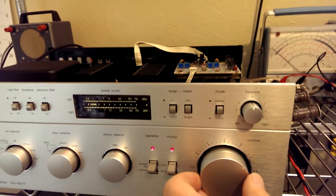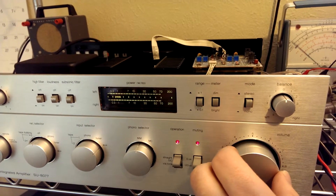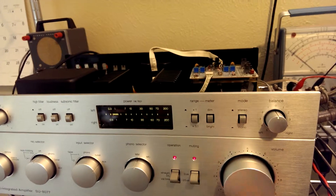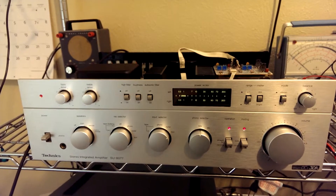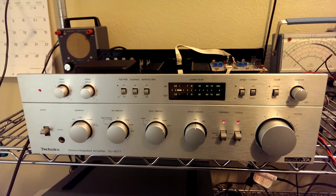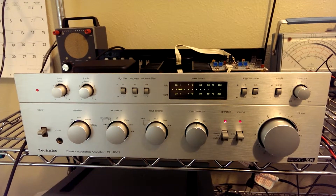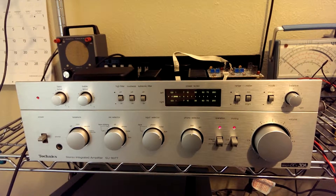The meters go up to about 70 watts and we'll go no further — you'll just get a ton of distortion. About what we would expect for a 60-watt amp. As you can see, it doesn't produce over rated power very much at all, but it does produce its rated power very, very cleanly.